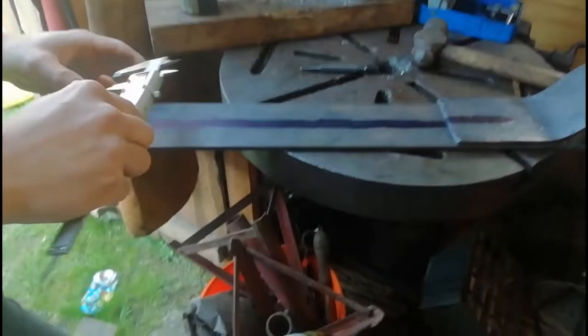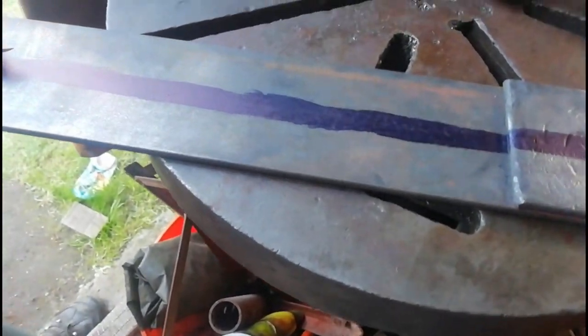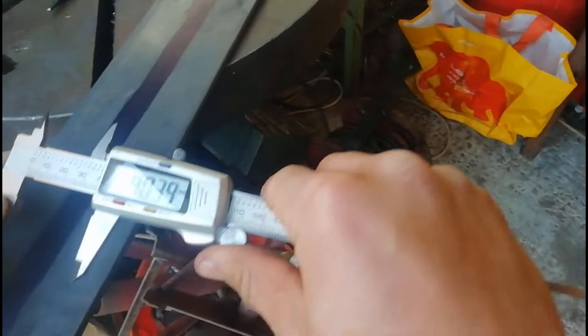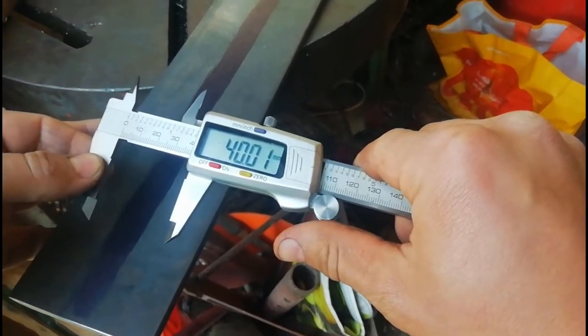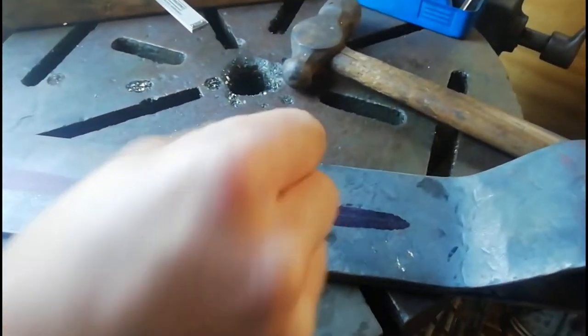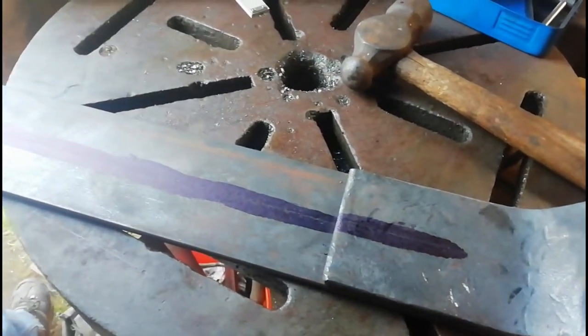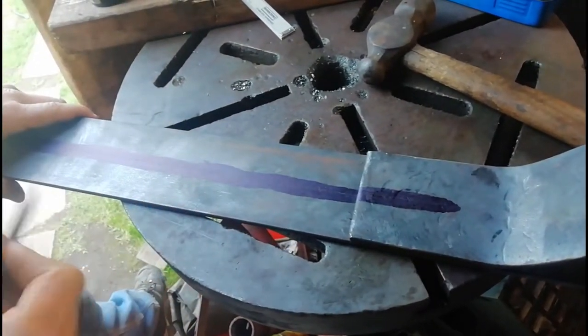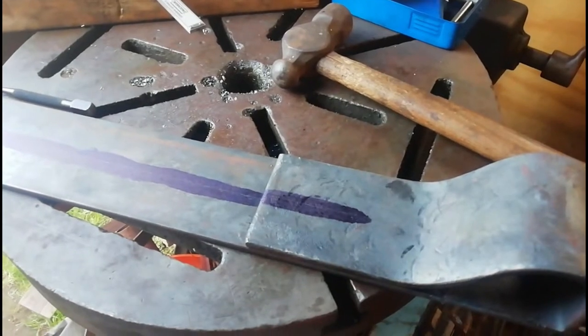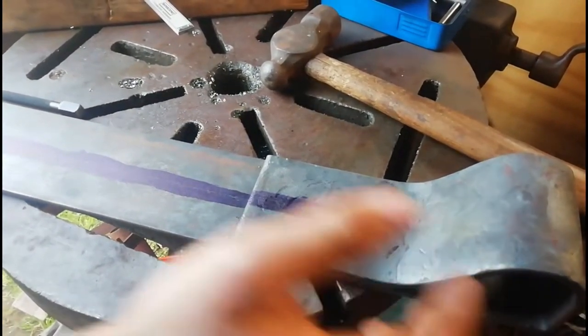Right, so we're just going to use the caliper — it's 40.4 — so we need to go 40.4, perfect, 44. Three holes: one in there to bolt those together, one and two somewhere. Then what we're going to do is put this one, then the two back plates in the middle, then the other one underneath all of that, and then drill it all at once hopefully.